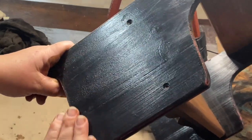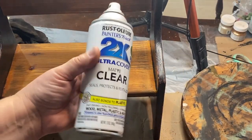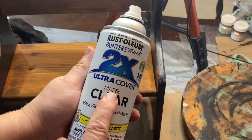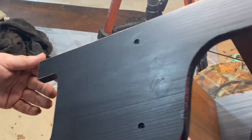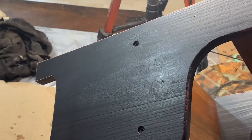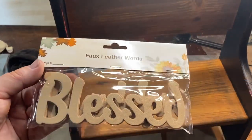I'm showing you the glossy shininess of this paint. I'm going to use Rust-Oleum Matte Clear Spray — this is what I use to seal my pieces if I don't use wax on them. I took it outside and sprayed it, and as you can see, it has that matte look to it now — it has definitely dulled it down. I gave the whole piece a nice coating of it.